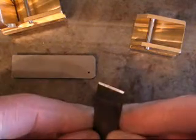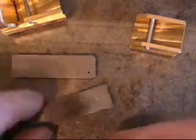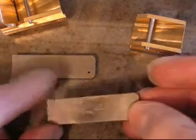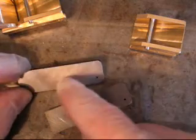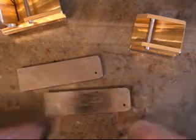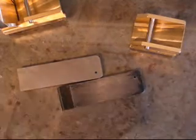These have had a quick touch on my number one honing guide just to get them ready to send away to the customer. It's up to them to really finish honing them later on, but they'll cut quite well as is. When I do a batch of ten of these irons, there are generally two, or at worst three, that are reject, because they have distorted in the opposite direction to give a convex surface. To lap a convex surface down to flat on the engineer's diamond lapping plate takes forever. It's much easier to select the ones that are concave, so you're lapping the two ends, which are the bits that matter — that's the business end, the one with the bevel. People say the irons function very well indeed.